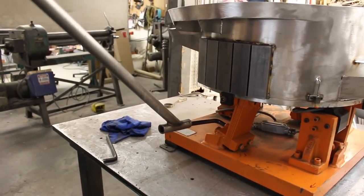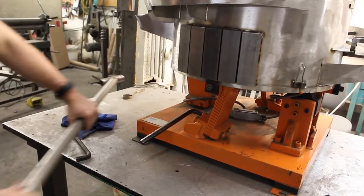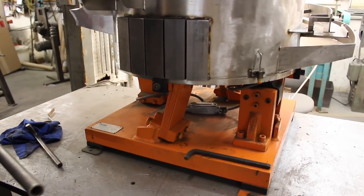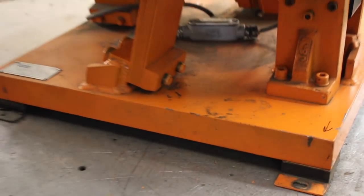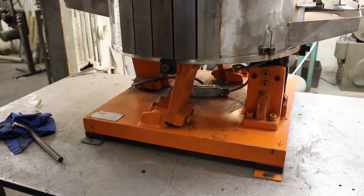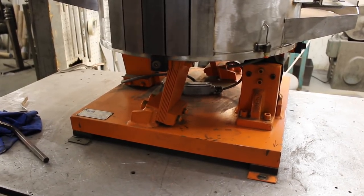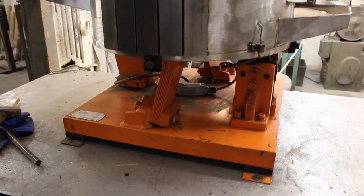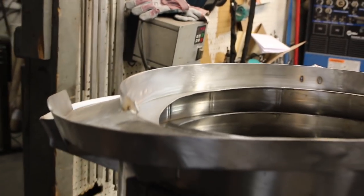If this was a brand new unit — you can see me really getting on that. I'll give you an example of how fast this unit is running: I'm just going to set my wrench on the end of the unit. That's what you want — see how that's moving? Good movement up in the bowl. You've got reserve power. If this is a brand new unit I would send it out just like it is now with this tuning, running about 55 on the dial. It's under tuned and it's going to speed up with new springs. If this unit had been out in the field for a while, I might add one more spring to it just to get a little bit more power out of it. You can see the parts moving around inside the bowl — that's a nice good movement. You've got reserve power. The unit's tuned. That's what you're looking for.